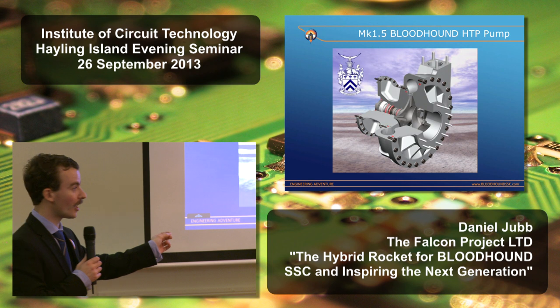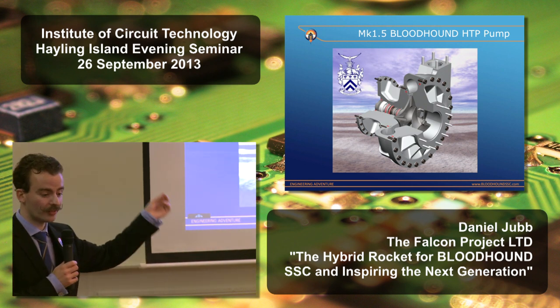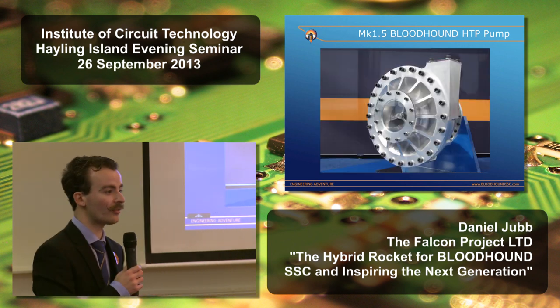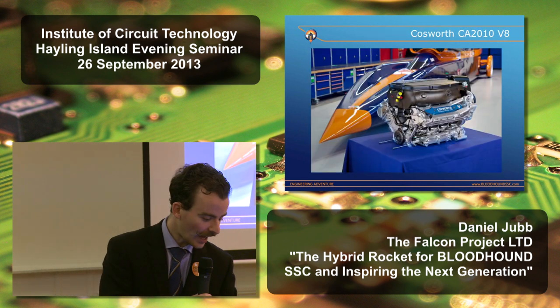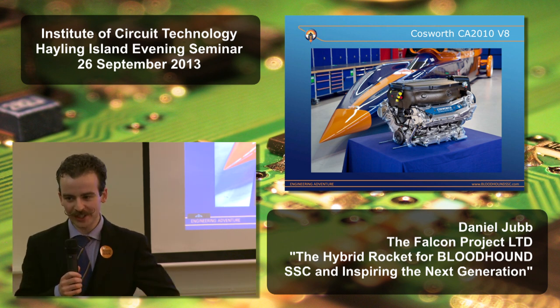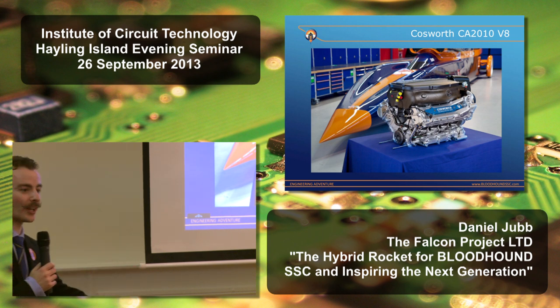This spins at 10,000 RPM. It takes HTP from the tank in the vehicle at 24 PSI and feeds it to the rocket engine at 1100 PSI. It was actually the first manufactured part of the car. They're on display at the Farnborough Air Show in 2010. And to power it, we need about 800 horsepower. Now, in Blue Steel, this was done with a turbine, simply using HTP decomposers to drive a turbine at 50,000 RPM, gave about 1,000 horsepower.